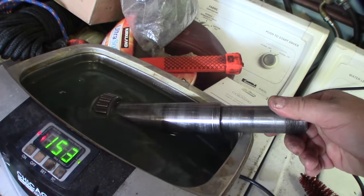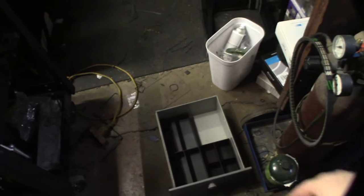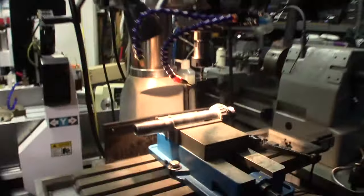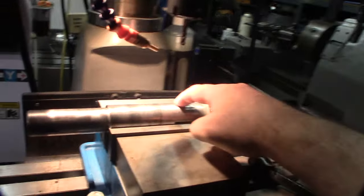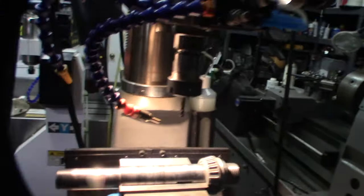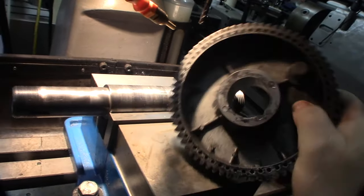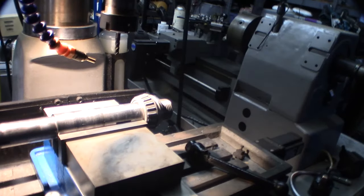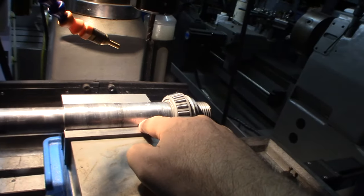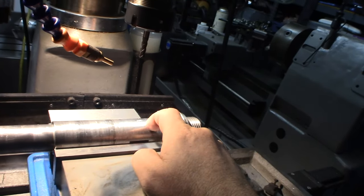It just runs like it has bronze bushings or something. In part two, as I'm rebuilding this thing - these videos span multiple days - I'm also designing some storage trays for the lathe boxes. The main spindle shaft - look at that big notch, I don't know what the previous guy did with the set screw but that's gnarly. To prevent that from happening in the future I'm going to create a flat spot so the set screw won't mar up the shaft surface the same way again.